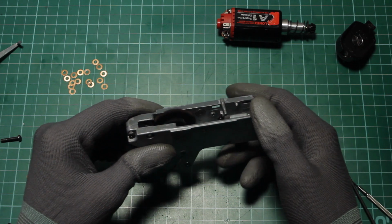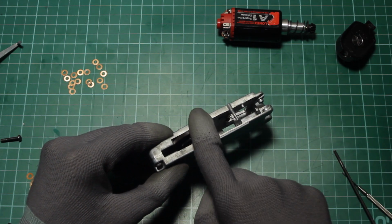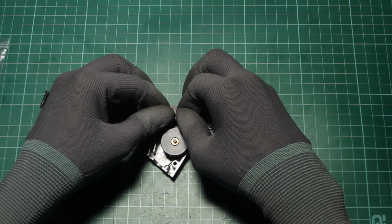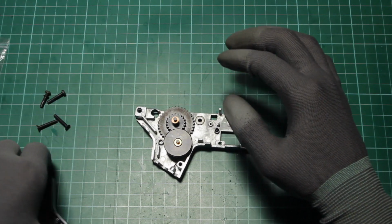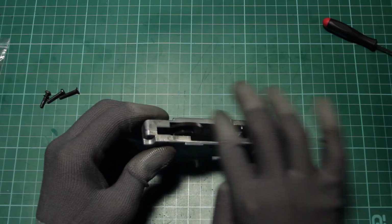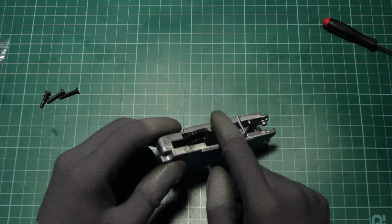After shimming the bevel gear and checking the spin, the spur gear developed a sound and vibration referred to as chatter. This indicates an instability against the bevel gear and revealed the need to add more shims to the spur gear. I did just that, and the sound went away. This goes to show that you should verify your shim job as you add on gears.